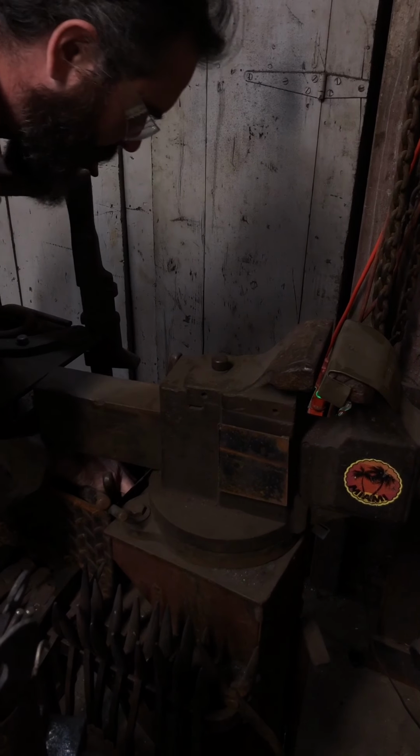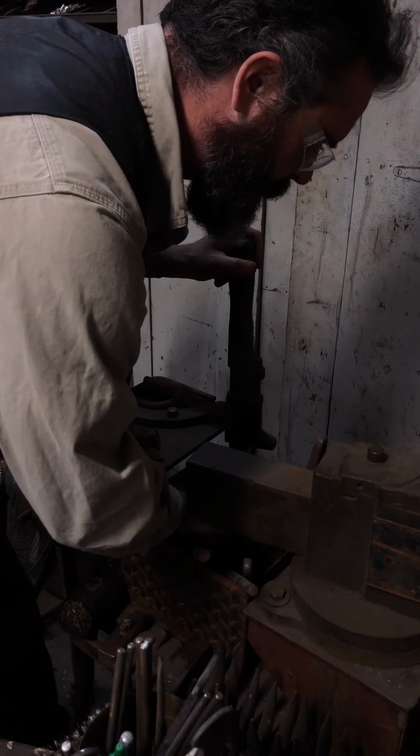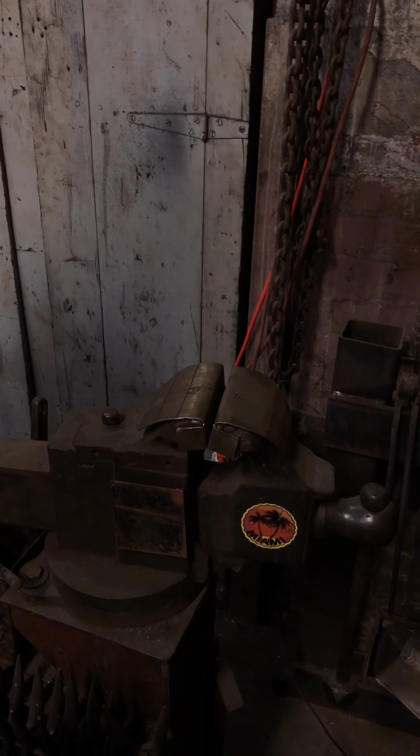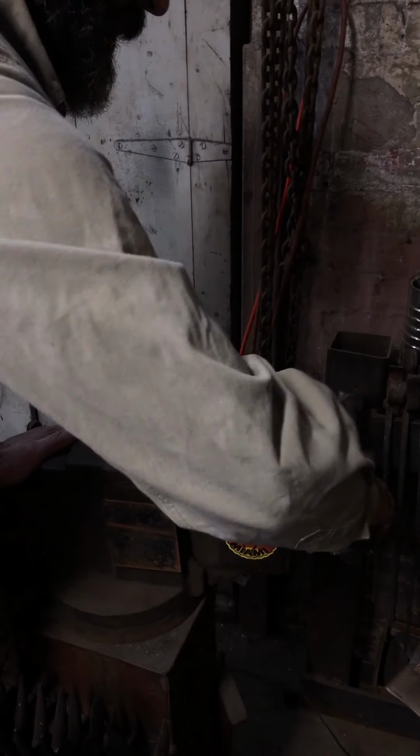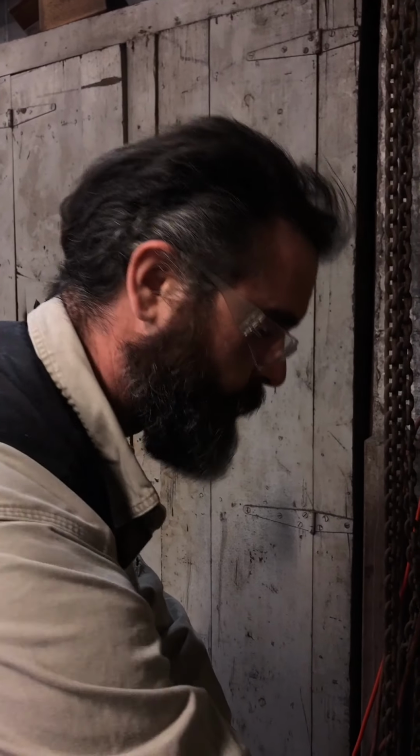And if you need something a little bit more protective, that's a really good way to do it. So then you can just lock them up, and it will reduce that marring on the surface. Obviously, these have a lifespan because every time you close it, they get compressed ever so slightly. So just be aware that you will have to replace them. I recommend minimum 16th inch material. Don't go any thinner than that, so 16 gauge. And if you really can get away with it, something more in the 1/8 inch plus range would be good. So, there you go.